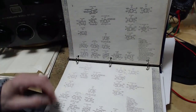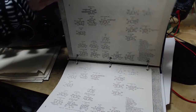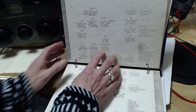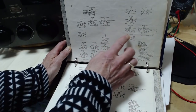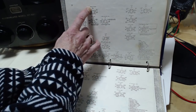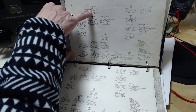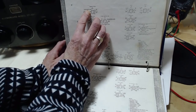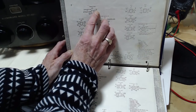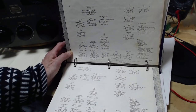Not so far back in the manual. So again, the confusing thing is, which radio do you have? It's all these charts. And I very cleverly wrote my radio on the right chart. So pin 7 of tube 7. Where's tubes V6, V8, V7. Tube 7, 455 kc IF gate. Pin 7 shows 390. And the same tube, pin 1, shows 380. So we know where you got those numbers now.